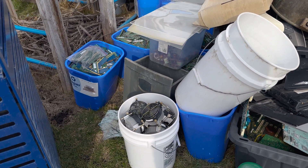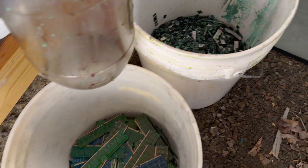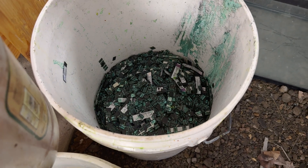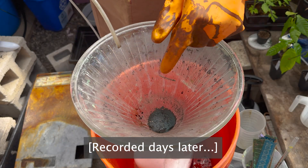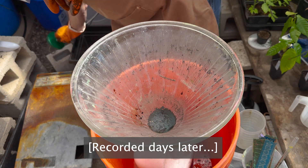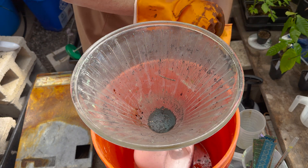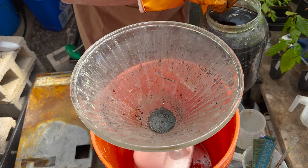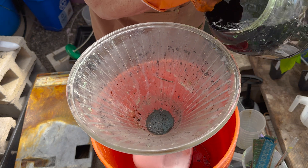We've got a whole bunch of chips to get off, and I'll get all the fingers off. I've got a cotton ball down here catching all of the fingers and any of the surface mount stuff after it's been through the tin removal. This was straight hydrochloric — 100% hydrochloric — so now it's all copper chloride.